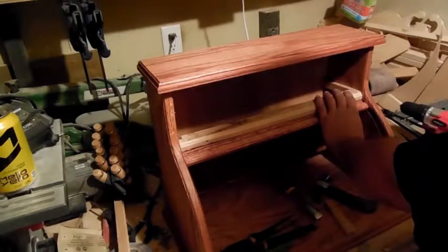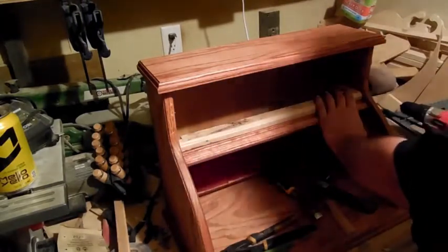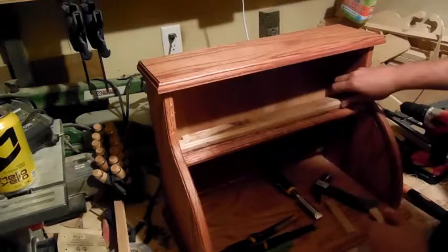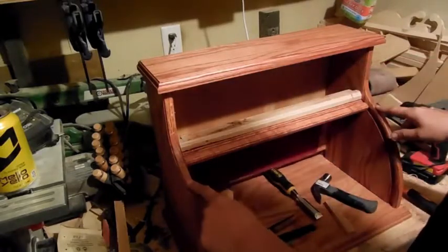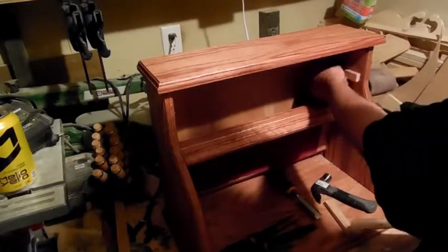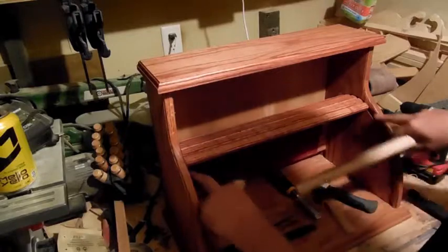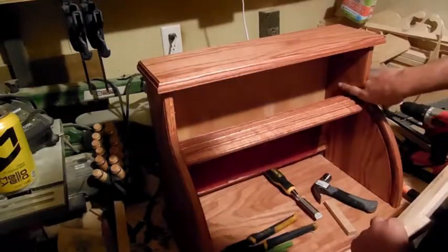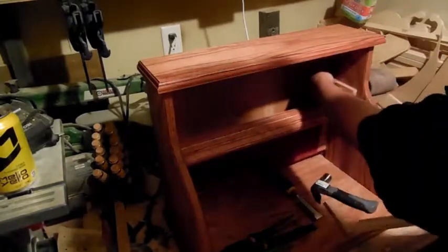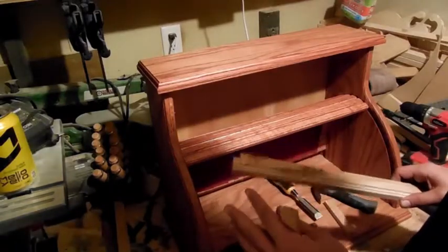This isn't a very big drawer when you count that I'm using three-quarter inch stock — it's not big at all. But it might hold some spare spices or something for my wife. If I were in your shoes, what I would actually do before assembling this: I would line up these runners, figure out where I want them, lay the two sides flat down inside facing up, take a straight edge, make a line across both that are identical, and then screw the runners into place before assembling. That's going to be the easiest thing for you to do.